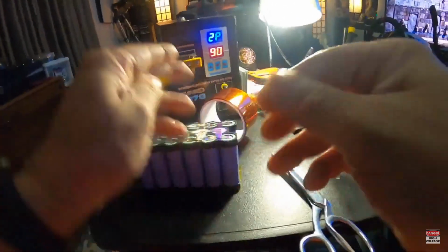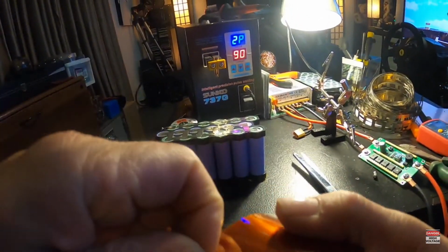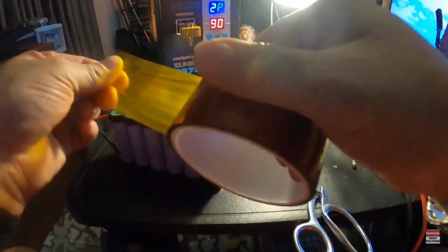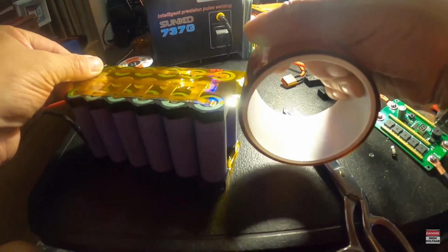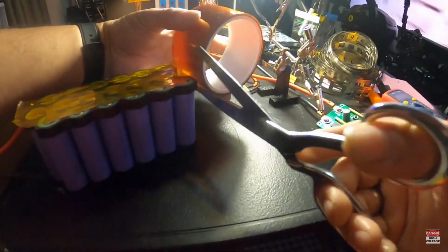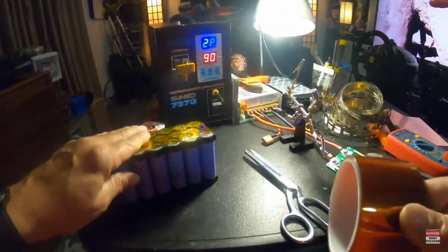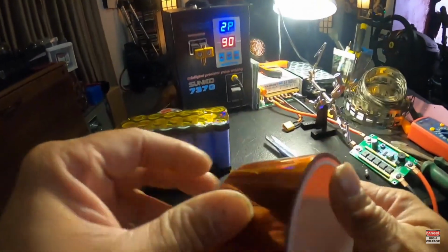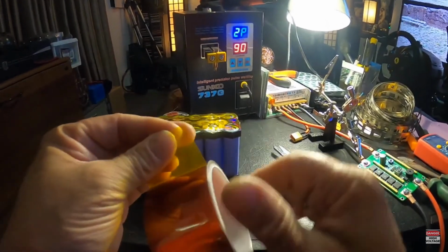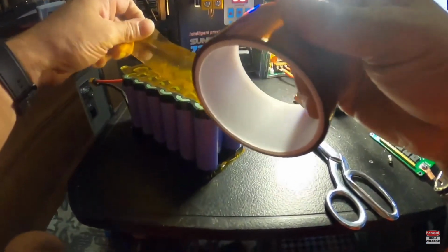Telling y'all now, when I build this race battery and I get them 450 amps to that controller over there, woo, it's gonna be hell to pay. Because right now, my system is starving for juice. And the speeds that I'm going right now is all raw speed, meaning with no field weakening. So right now, that controller is dealing with all that back EMF that's being created by that motor.